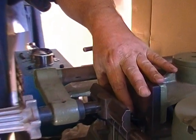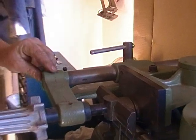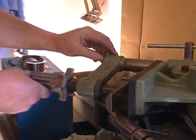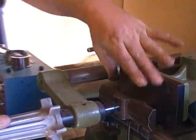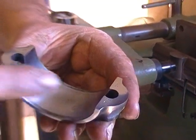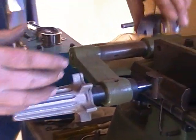We set up on the rod and attach, then turn the machine on. It uses very precise bearings to swing the cap over the top of a cup stone. We'll be making several passes — you can see that we're starting to create a bright spot here, and that's where the metal has been removed to return it to flatness.